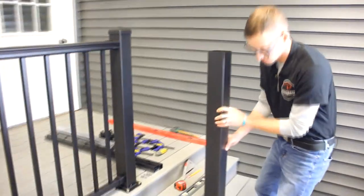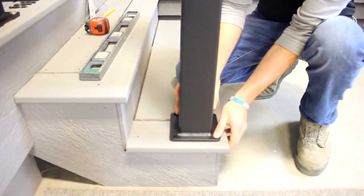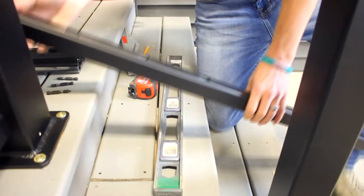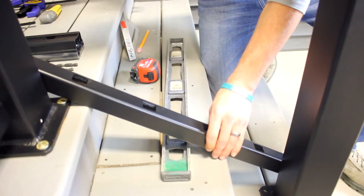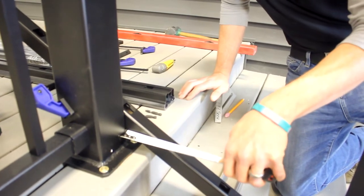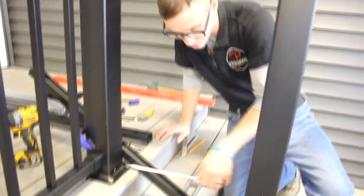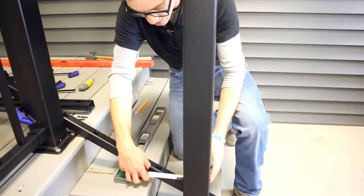Taking our 45-inch welded post for the bottom of our step, set it up against that line. We're not going to attach it just yet — we have to double check the spacing on our rail for this in-between post to post. There might be some slight adjustment, but we at least know this is the line we want. Taking our bottom rail, set it up against your posts to find a spacing that looks right, then we'll double check. Clamp on the top side of your railing section, then from the post straight out to your hole, measure that — it should be between two and a half and four inches. We're at three and three-quarter inches on both top and bottom, so we're evenly spaced.